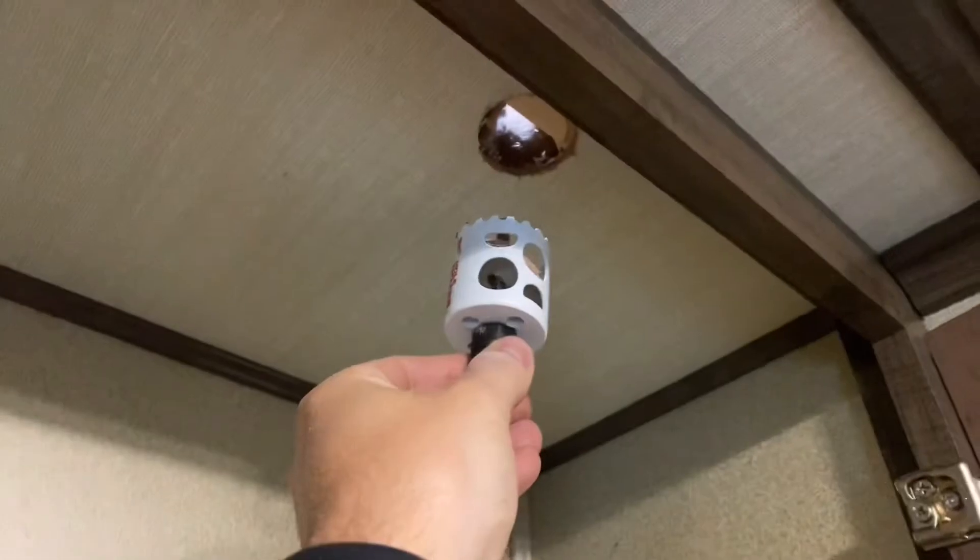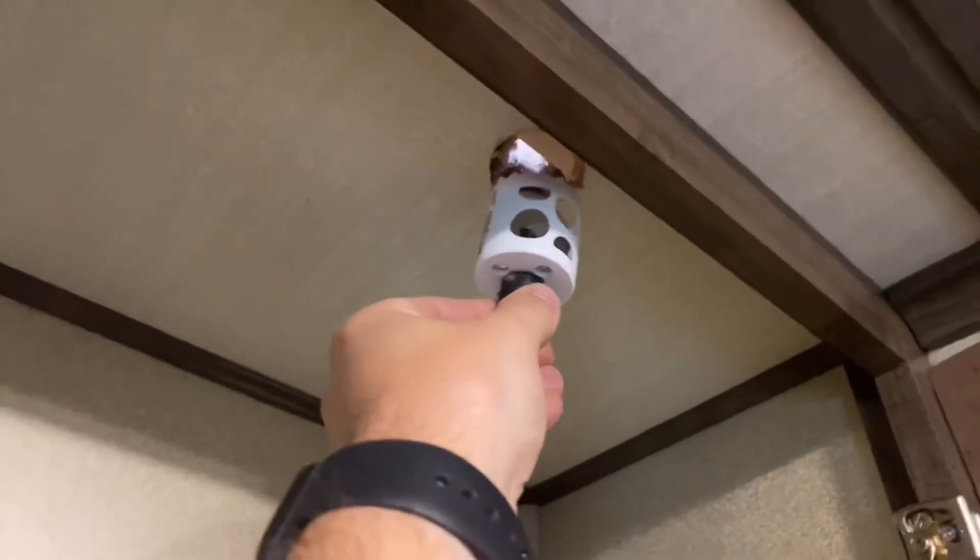I said okay, this is where I want it to go right here. I didn't drill all the way through — I just started it with the little one so I knew I had clearance on the right side. Then I took the 3/8" drill bit and got a hole in there so I could get my scope up through, and it looked clear. One thing I failed to notice was this stud right here. You can see that I started to jaw into it a little bit, cut into it, and I stopped.